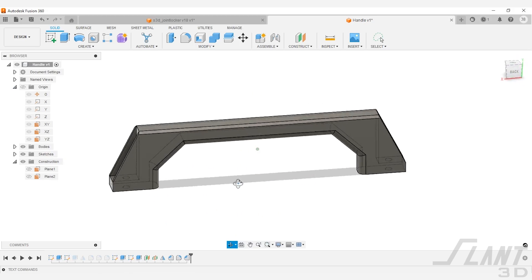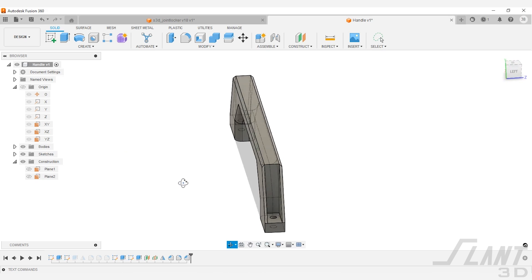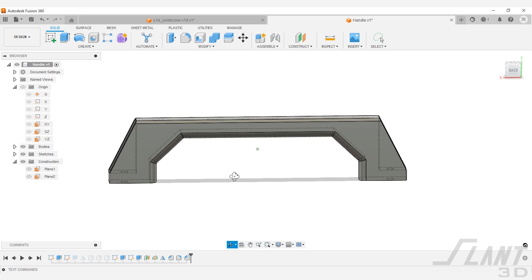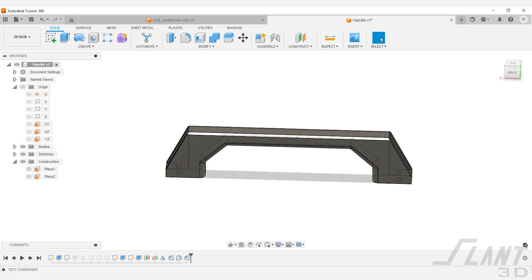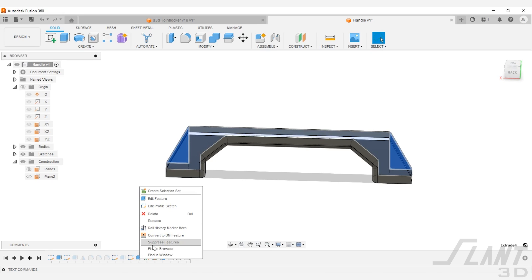There's no controlled stress concentrations or anything else — this handle is perfectly decent and could be used for furniture or industrial equipment. But while you could follow this principle, it doesn't look very good. It looks kind of amateurish. There's a next step you can take this to where you actually use the chamfers and lean into them completely.